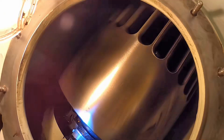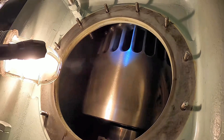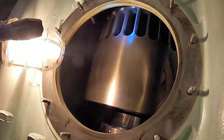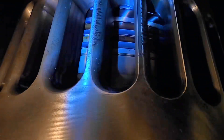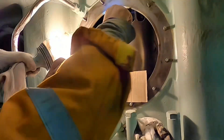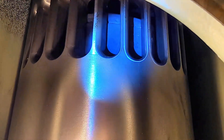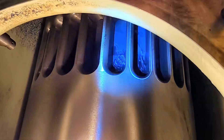The fact that the rings move in their grooves will also tend to transmit the local seizures all the way around the liner surface. If extreme seizures have been observed, it is recommended that the cylinder oil feed rate is temporarily increased. If load reduction of more than one unit is required, it is recommended to contact the engine builder for advice. If there are scratches observed in the piston rings, it may be caused by hard abrasive particles originating from the ring itself, or more likely from the fuel oil or air intake. The actual scratching is not necessarily a serious problem, but the particles can have serious consequences elsewhere.